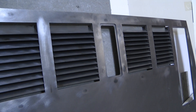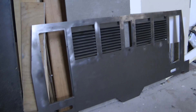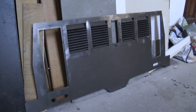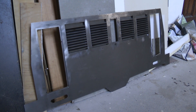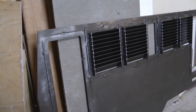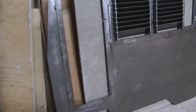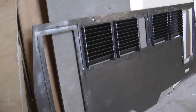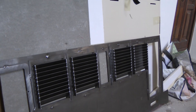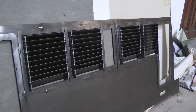These are the vents with some really fine one-millimeter-thick grills, and they turned out well. This was my first attempt at welding 1mm plate with fairly low settings, and I think it looks good. From the other side you can see I tack welded a few places — I may need to add a few more tacks, but I didn't want to add too much heat to the whole plate because these are really thin sheets of steel.